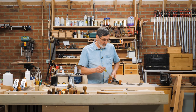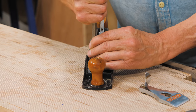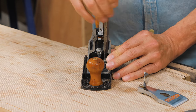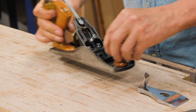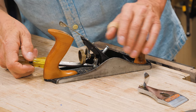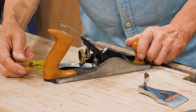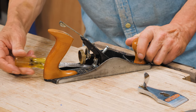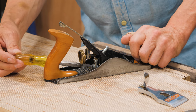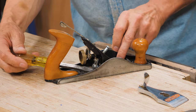What goes wrong is that people think you can move this frog way back — you unsettle those two set screws, go into the back underneath the adjustment wheel and turn this set screw here, and it will bring the frog way back in the plane. Turn it clockwise and it'll send it forward.